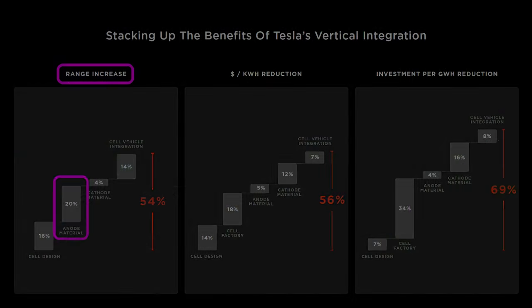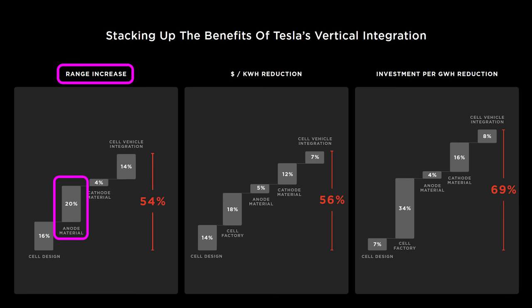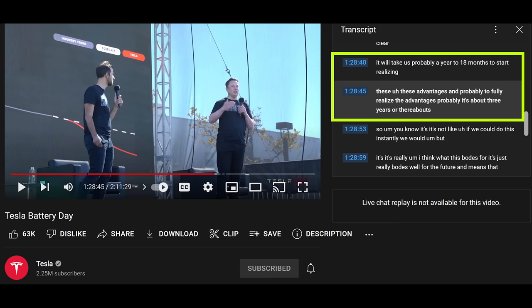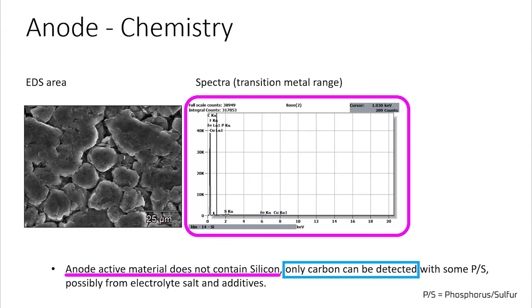What Tesla proposed at Battery Day was to stabilize the silicon with an elastic, ion-conducting polymer in combination with a highly elastic binder, expecting to eventually increase energy density by about 20% at the pack level. If you'd like to know more, check out my Cracking the Silicon Code video. Tesla advised at Battery Day that the horizon for these technologies was 3 years or thereabouts. And as I advised in past videos, like the rest of the industry, it was unlikely Tesla was going to go from a low loading of silicon to a high loading in the first-generation 4680 cell — it's better to increase silicon incrementally to de-risk the production ramp. I didn't expect no silicon; that was a surprise. But no silicon makes sense as well.